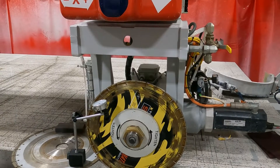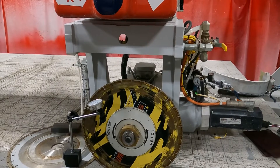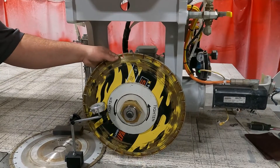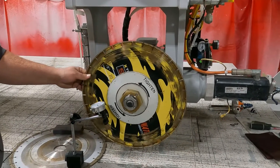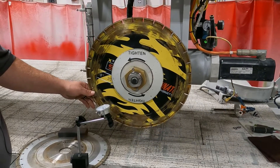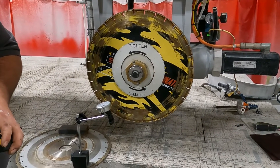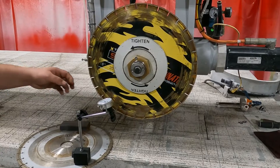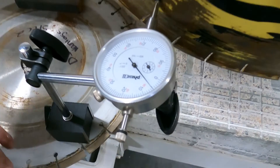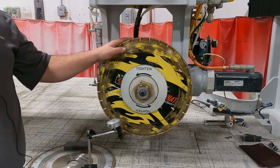My indicator reads zero. Now I'm going to slowly begin walking my blade up, and as I do so I'm going to turn my blade to get my point towards the bottom. Now I'm at my point — looking at my reference here, I'm five thou out. That would be considered out of tolerance and would need to be adjusted.